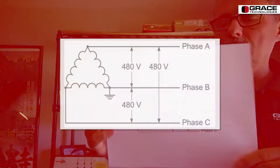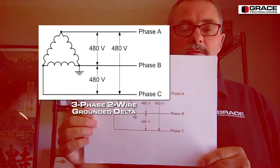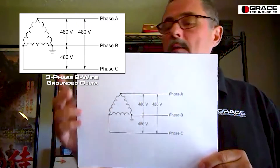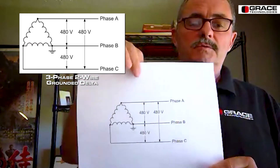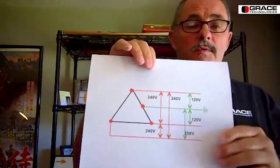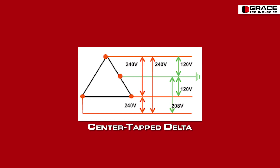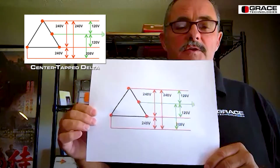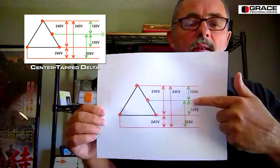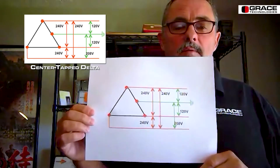In this situation, you're almost always going to have the ground light on. This is a grounded B phase, so there's always imbalance — that ground light would always be on in this situation, or in the last situation with the grounded delta. Also with this one — another type of center-tap ground on a delta, used on single phase — if you have a three-phase transformer on the pole out by your house, they will take off like this for your single-phase energy. Since there's always imbalance here, with always potential voltage, that ground light would be on.